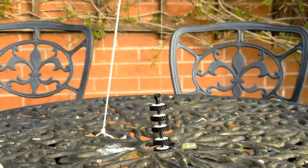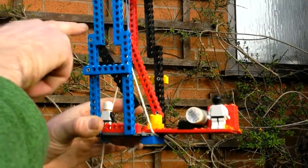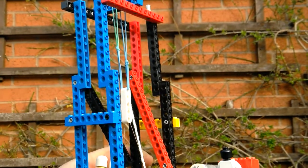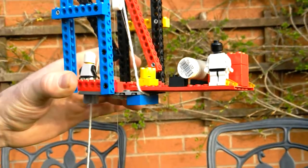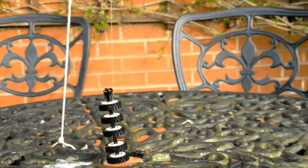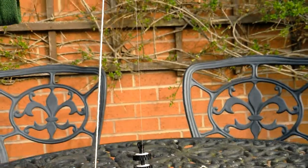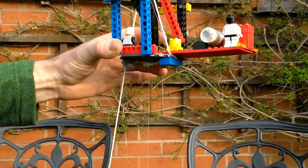The limits in terms of weather in a theoretical system such as this - the real limit is the stroke of the compensator piston or the stretch of the elastic band. The stretch of the elastic band is half of whatever the rig is moving at. So for every one metre of stretch of the elastic band, the rig would need to move two metres. The actual heave limit in this theoretical system is really quite high. You can see even with a lot of motion of the drill floor, the wireline tools are dead stable. So you can do your sampling or your coring or your pressure tests with good confidence that no matter what the heave of the rig, your wireline tools are static in relation to the wellbore.